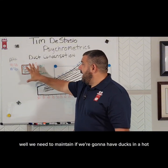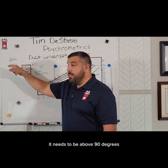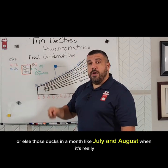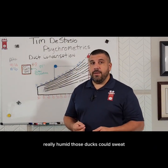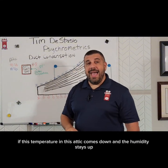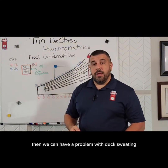We're going to have ducts in a hot, humid attic. We need to make sure that that attic is actually hot — it needs to be above 90 degrees — or else those ducts in a month like July and August, when it's really, really humid, those ducts could sweat. If this temperature in this attic comes down and the humidity stays up, then we could have a problem with ducts sweating.